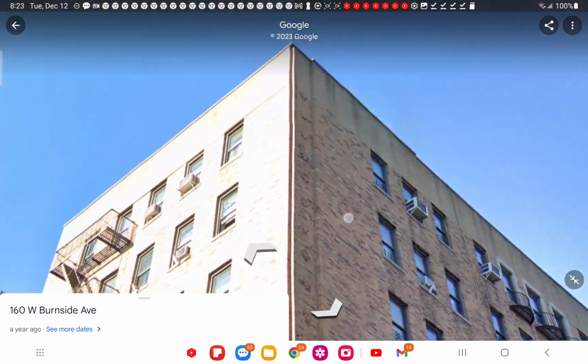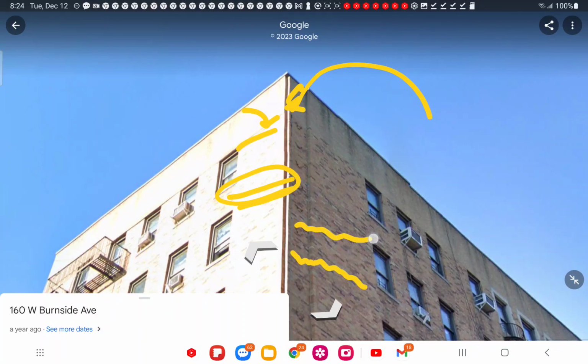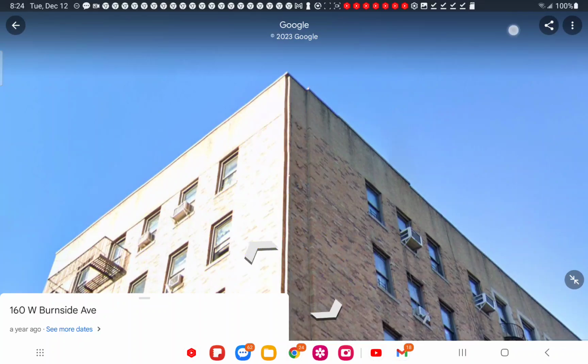It's interesting, the top two floors still have the cantilever. The floors are doing pretty good, these two. I believe it is the roof, the ceiling there. There's a lot of redundancy behind this one. But this one is pretty rigid still. That's interesting. Again, I think the issue is the details, the devil's in the details, those corner tie-ins. This is the load-bearing side of the floor joists, where the floor joists tie back into the structure, back to here. And this is a wall that's tied at the corner here, so-so.